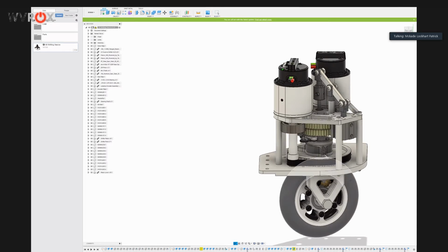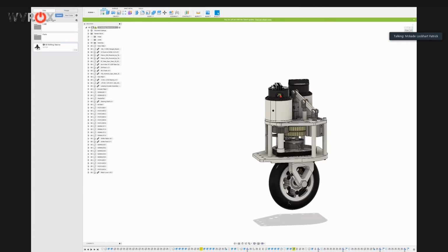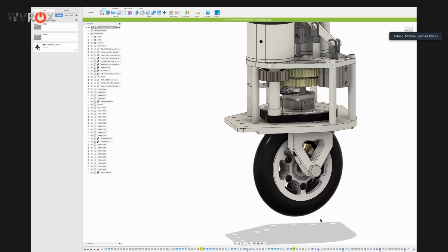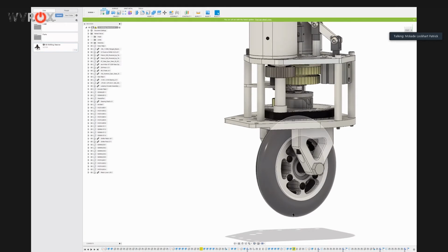Sure. We can talk a little bit about why we're using the pneumatic wheels. So one of the major design changes from 2910's modules is that they use 4-inch traction wheels. So we found these 5-inch wheels, they're actually Nordic skate wheels, so they're 5-inch pneumatic tires. There's a few reasons we wanted these. For one, we can swap in 4-inch wheels, just the same wheels 2910 uses, if we wanted to. So nothing really changes, but this gives us a lot of advantages. One is, of course, going over obstacles, like going over the center bars, which was helpful.